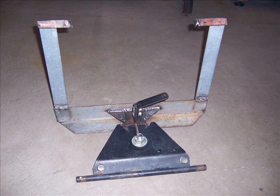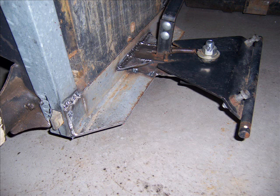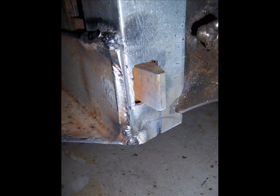There's the whole blade mount ready to fit onto the bobcat — that's the front view. There it is on the bobcat. The two bolts that stick up on the left and right side are the stops for the blade so you can control the blade angle. There's a side view getting ready to put the blade on. I didn't paint anything — I wanted to test it out. There's a view of the latch holding the thing onto the bobcat. Right side, left side.